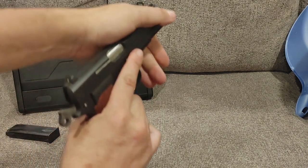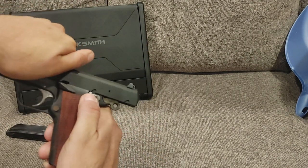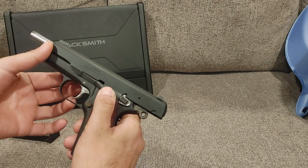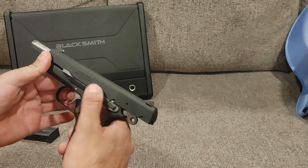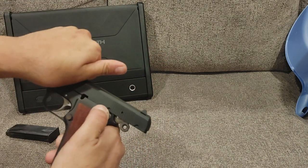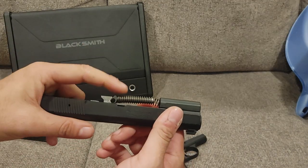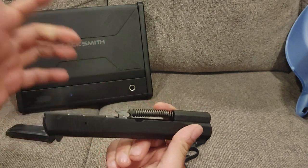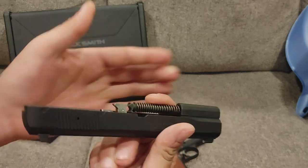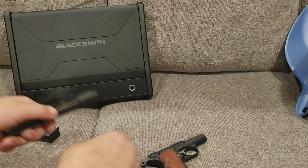What do you say we take it apart? Go ahead and check it, make sure there's nothing in it. And unlike a 1911, you're going to come all the way back to the secondary notch. Lift up on the safety, and you're going to wiggle your slide lock out — just push up while moving it out, wiggle it around a little bit, and it comes free. Once you've done that, you can pull back a little bit, drop your safety, and voila, the gun comes apart. This is very much a High Power pattern, so pay attention to which way the recoil spring is inserted into the slide — the angle it sits at is very important because you cannot get it back together if you don't.